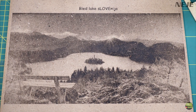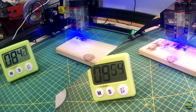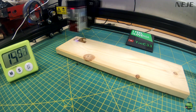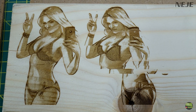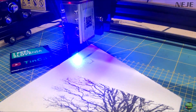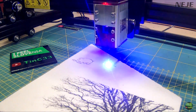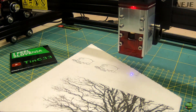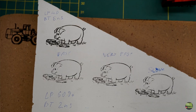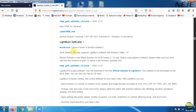I tried to engrave an image about 20 by 30cm. It took about 10 hours with the motor speed set to slow. Then I tried the same engrave with the same settings but changed the motor speed to max — it was about 4 times faster. But during the engrave the X motor lost steps a few times. I think that function is more suitable for the 32-bit motherboard; the one I have here is still running on 8-bit. I also tried changing motor speed settings in another test — it worked much faster and didn't lose that much detail compared to the time saved. For more quality engraving, lower the laser power and raise the burning time, like that piggy on top where I used fast motor settings.